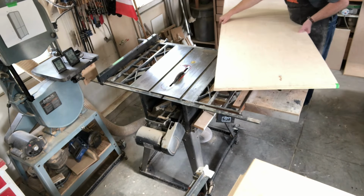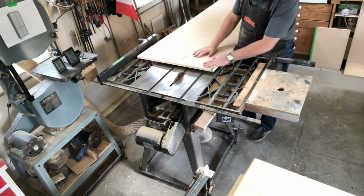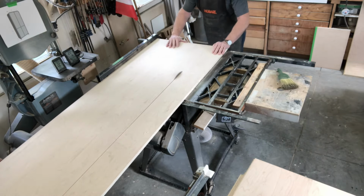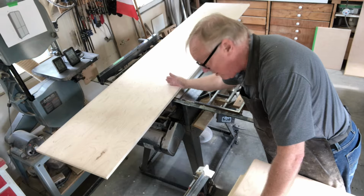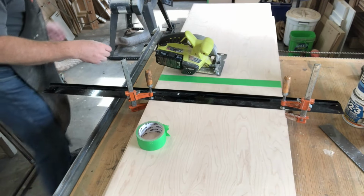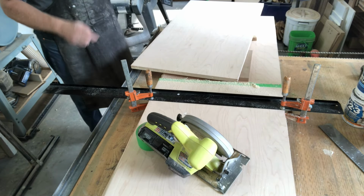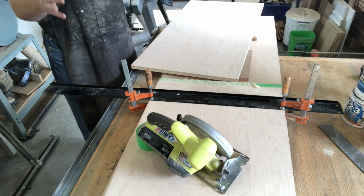Okay, we are ready now to cut our anchor shelf. The anchor shelf and all other shelves are going to be the same width, 20 and 1/8. So I'm cutting 2 pieces out of this one piece of wood. Next step will be cutting these into 37-inch, one piece, 37 inches. That'll be the anchor shelf. The other shelves are going to be slightly less than that. You can use the circular saw to cut this anchor shelf to length. So we now have both pieces, the top is cut, bottom shelf is cut, the anchor shelf is cut. We could now work on assembly of the cabinet.